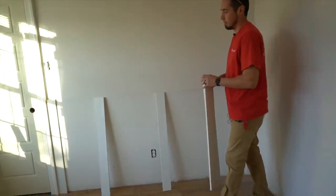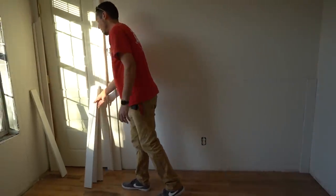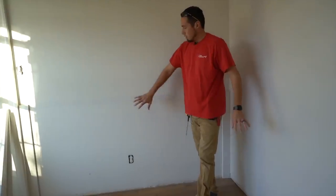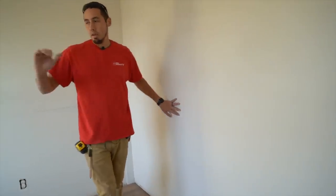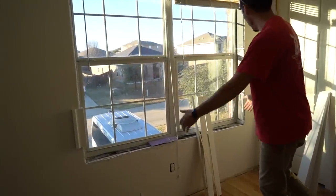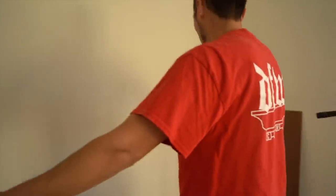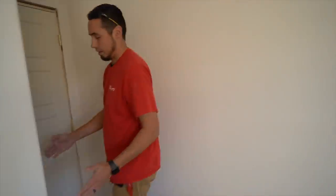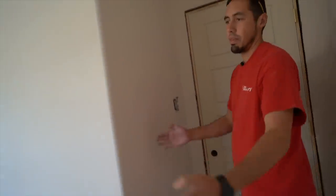When I start this process of determining panel dimensions, I go to the smallest wall I can find in the room. This wall right here is not the smallest wall, and neither is that one. If you look that way, we've got a wacky situation under the window, a small space, and a large section. The wall I would consider the smallest is right here — and this is what I would use to determine the rest of the room.